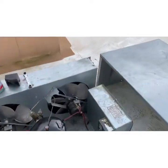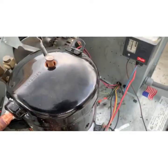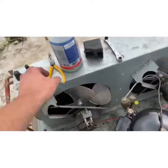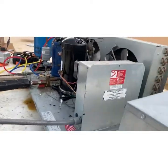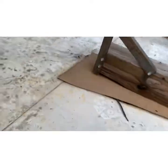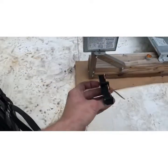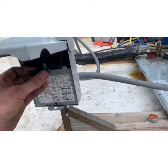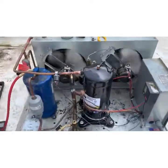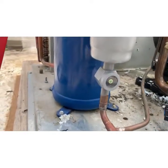We put four pounds in it. Got my terminal set. Let's go for it. Other than I lost the disconnect — I kicked it under the unit. So when I put this in, compressor should start, fans should start. I'm definitely going to be low on gas. I'm going to get over there and fill it by the sight glass. Three, two, one — don't blow up. Side glass is real low. Here we go. Bleeding in juice.